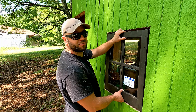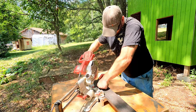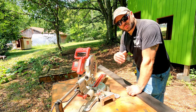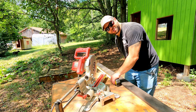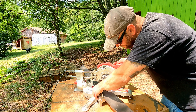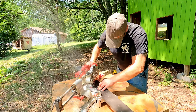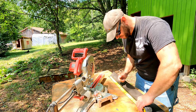Now I think what we can do is start figuring out our trim work and start putting that in. I got our first 45-degree miter cut. The window is 25 inches tall and I'm gonna go with a quarter-inch gap, which gives me an eighth-inch gap all the way around — I'm hoping that'll be enough to let the window swing open. So from the inside corner I need 25 and a quarter to the other inside corner. There's our first piece. The window is 20 inches wide, so from inside corner to inside corner I want to be 20 and a quarter.